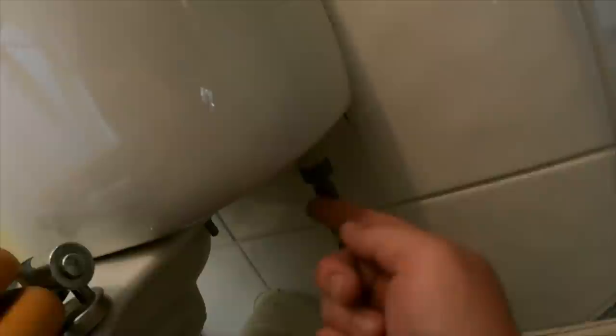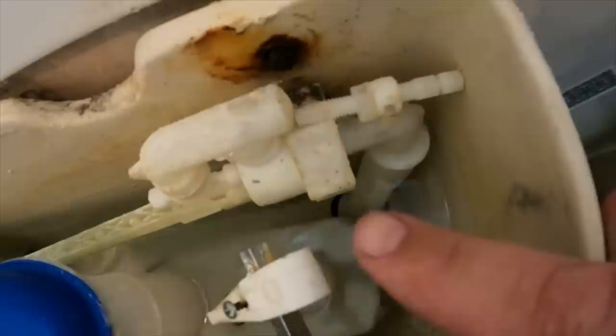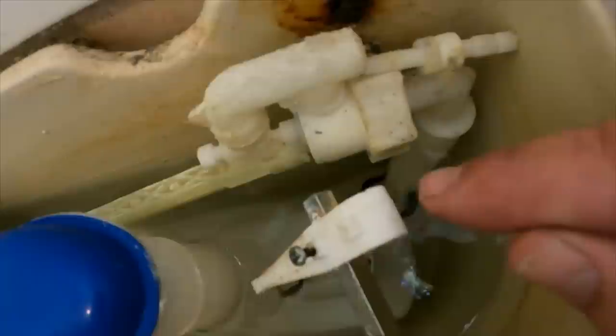So this is the culprit - the second toilet in Matt's house I've had to sort out and it is leaking, just ever so slightly there. What we're going to do is fairly straightforward - just whip this ball valve out and put the new one in. However, if you look down there, you can see the edge of the body of this ball valve is just underneath that siphon. So I'm hoping when we get it disconnected it's going to slide out. If not, we could be in for a little bit of a mess around with the siphon. It's definitely passing quite a bit - not what you want.